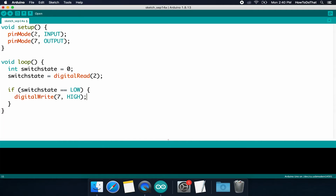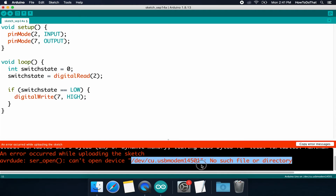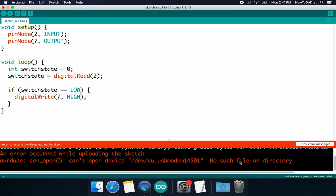Okay, now that my board is plugged in, I'm going to come up here and hit the upload button. And you'll see it do some things down here. So you'll notice that I got an error down here. Now, I'm actually really glad that this came up because I get to show you how to fix it. It says an error occurred while uploading the sketch. Can't open device, no such file or directory.